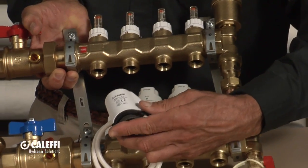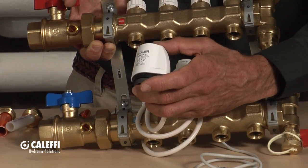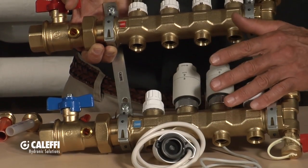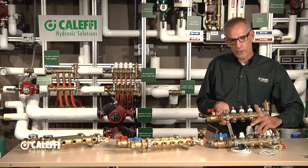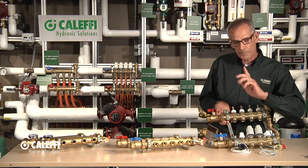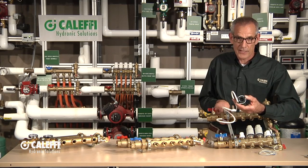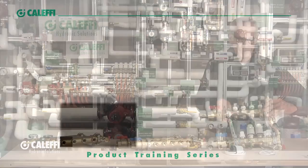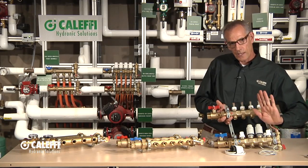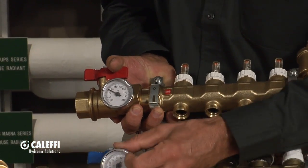We also have another new actuator that will indicate flow when energized by popping up. This is a low current draw actuator — it uses less current, so if they all kick on at once you won't over-amp your transformer. It's also hermetically sealed, which is important if your loops go up and you flip the manifolds so piping goes up. On a chilled water system, condensation could run down and get into the valve electronics — but with this sealed actuator, no problem hanging it below the manifold. If you do flip the manifolds, the air vents on the end are adjustable so you can rotate them to keep them facing up. We also have push-fit temperature gauges to read supply and return temperatures on this manifold.